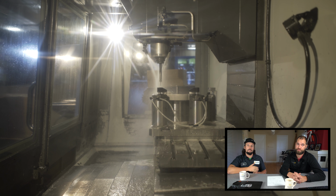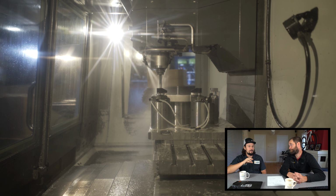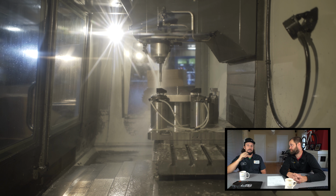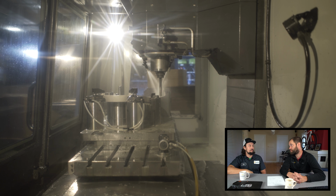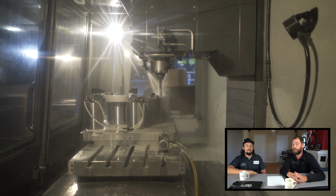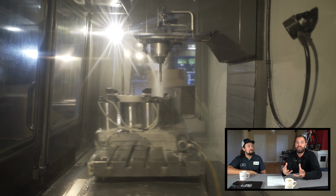And keeping that distance between the resistance unit and the circuit board is essential, because we have a temperature compensation sensor on that circuit board, and it needs to be close enough that it can make the adjustments necessary as you heat up the trainer to keep you accurate. But it can't be too close where you'll accidentally nick it if anything were to happen. And that temperature sensor that Nate's mentioning is sensing the temperature of the actual flywheel.